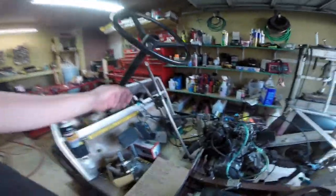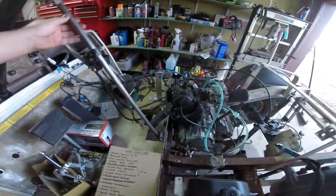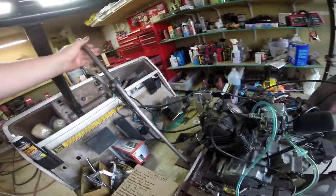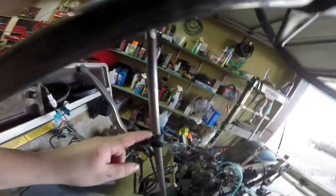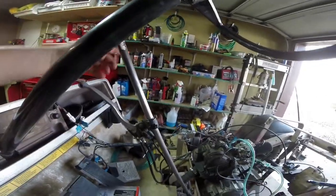Let's take a look at what we've got here. Got our shaft down there, it's secured left and right. There's a little bit of wobble, not a ton. There's our linkage down there — we can shift — you can see it working. I shifted up and down through all the gears; we're in neutral right now. What I did was I cut a piece of pipe on here and hammered it on as a spacer. I don't remember what diameter this pipe is, but it's not the right diameter for this.